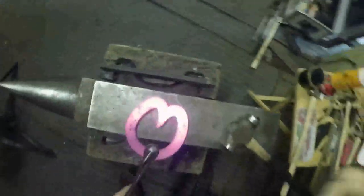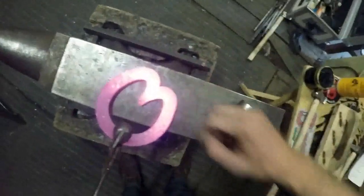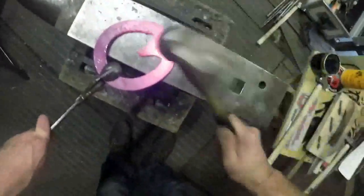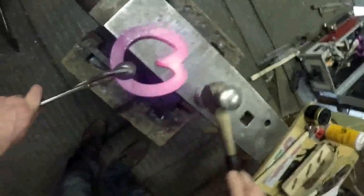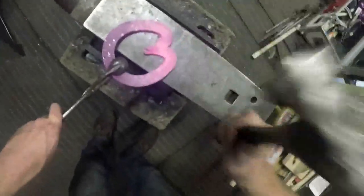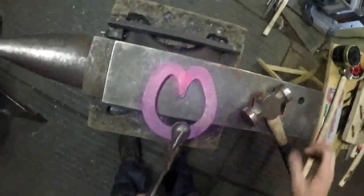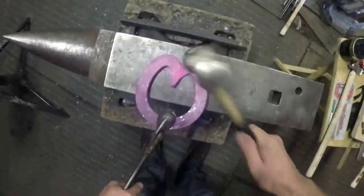And then, everyone welds differently, but this is just the way I find works the best for me. I forge that surface in there, I forge that surface in there, and it's bent both branches, both frog plates, out, so I'll just pull them back together. And then I use the toe of my hammer, which is quite unconventional really. Most guys use the heel of the hammer to forge scarves in. But I just find using the toe of the hammer works better for me, but it's your call. If you want to use the heel of your hammer, no big deal. And you see they've moved apart at the tip there again. Just pull them back to where they want to be, so they're both nicely overlapping.